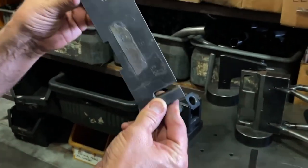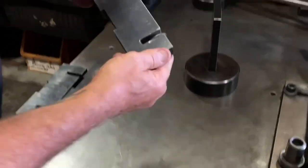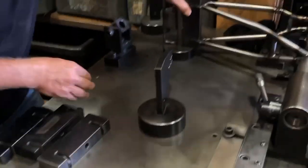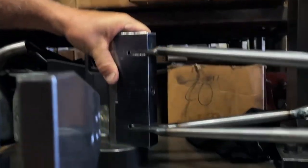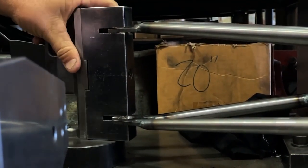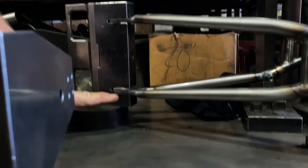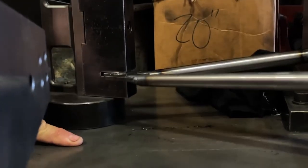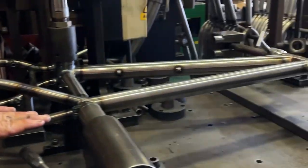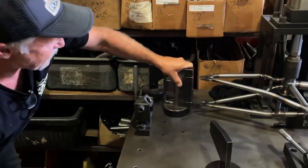We also have blocks for 135 — that's sort of a mountain bike spacing that we're using on the booze cruise — and then also a 110, which is what you would use on a race frame. So our block is sliding perfectly in. We know that the dropouts are parallel to one another. They're also 112, they're also the correct height and center to the table. So the center of the bottom bracket, center of the head tube, center of the seat tube, center of the dropouts — everything is on the same plane. That's the idea there.